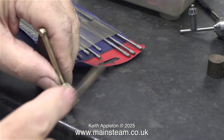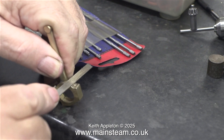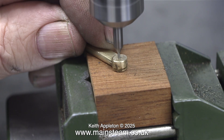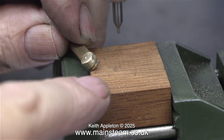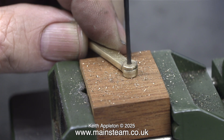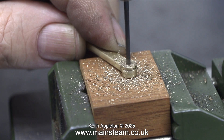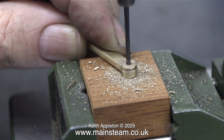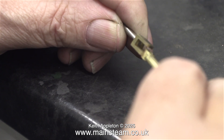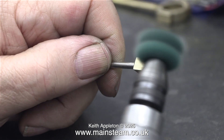After a while I went back to the needle file, because there were certain areas where the belt sander wasn't quite accurate enough on the edges to get the finish that I wanted — I didn't want everything to be slightly rounded. Now it's time to drill the hole in the end, which will connect the eccentric rod to the valve fork. Here I'm using a centre drill to make the hole just about in the centre, which is difficult really, because the end of this part is not really shaped properly. There's still the casting sprue on it, so I estimated where I needed the hole to be drilled, subtracting the thickness of the casting sprue on the outside edge. The part did not fit in the valve fork, as you can see here, but it's quite neat, so I'm going to keep this one. I cleaned it up using the scourer, and this was very good at doing that.